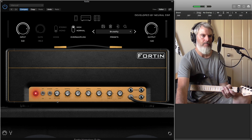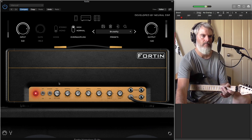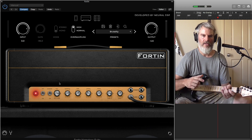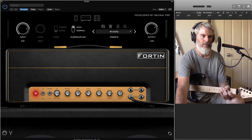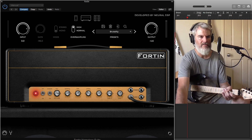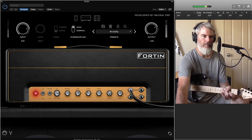Now to the main amp face. If I push the volume pot in, it really is just like a volume control. But when you pop it out, it's still a volume control, but you can see it changes the dynamic and adds a lot more density to the signal as you turn it up. This is what's unique between the stomp effect gains and the gain on the volume — depending on the input you use, you're actually utilizing both of these gain stages.